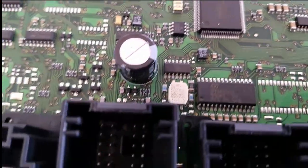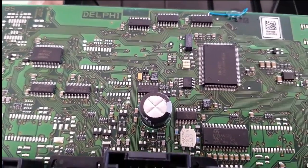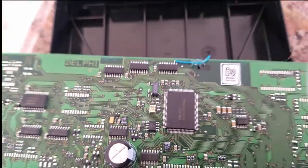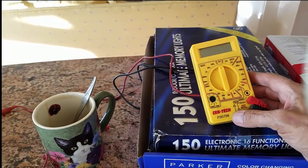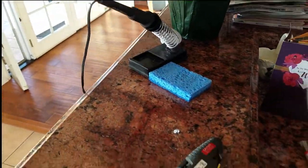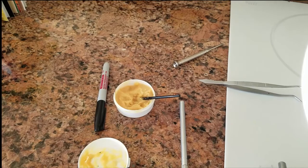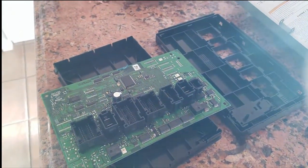In this little guy here, sometimes the transistor goes bad. The first thing you've got to do when you pull out your SAM is clean it off really well with alcohol, then inspect the traces, clean up any dirt, and check these little tiny transistors. Check your capacitors, surface mount capacitors, and your resistors with a voltmeter. Tools you'll need: a good voltmeter, a soldering iron, a hot glue gun to hold the bodge wire down, some flux and solder, and a little bit of wire wrap wire in case your via holes are burned. And of course you need your rear SAM unit — get it out of the back of your car.